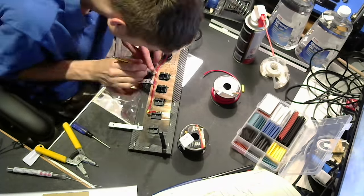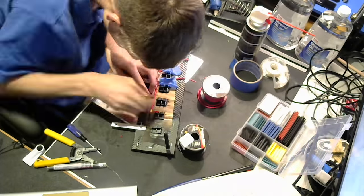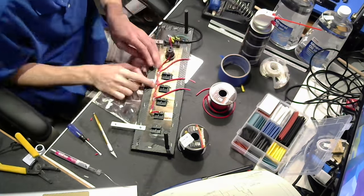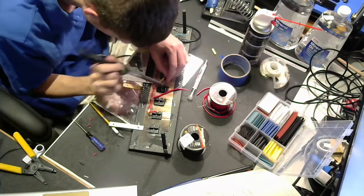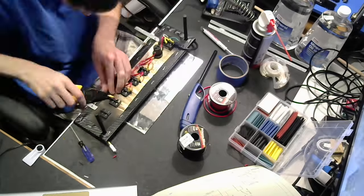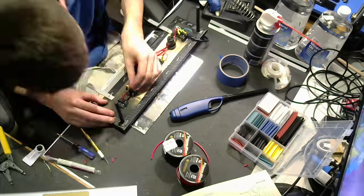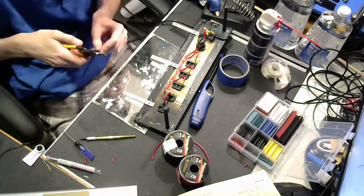But to explain the circuit as best I can, it is a series of lined up switches that feed off 120 volt input power. The input power naturally comes from the wall outlet, 120 volts, 20 amps, through the 15 foot long NEMA power cord, which I did cut in half, into the main switch, which is that electromagnetic safety switch that I mentioned earlier.